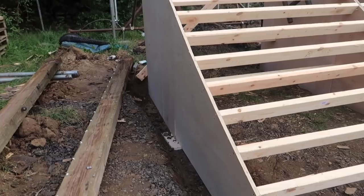So the whole framework behind me is now in situ. It's in place. And the thing that took longest was getting all the footings, which is what it actually stands on, level, because this ground isn't level. I spent quite a lot of time over there making a level platform to build those on. So it's important that they actually sit on level ground, and now they do. I've had help from Greg, Sam and George getting all those dug in. A bit overkill, a bit too wide, but we weren't sure how wide this was gonna be.